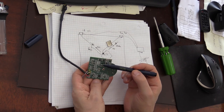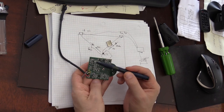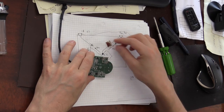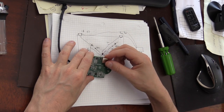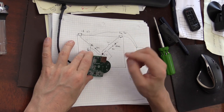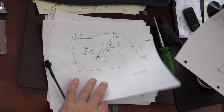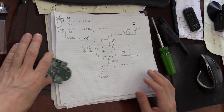Because this has high-Q, low-ESR capacitors, I believe this board does some serious filtering right here. Some reverse engineering of this preamplifier: only the circuit behind the shield right here. And so here is the schematic that I've been able to recover from it.